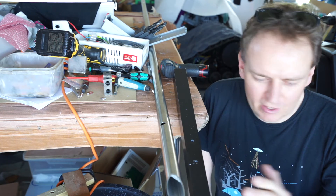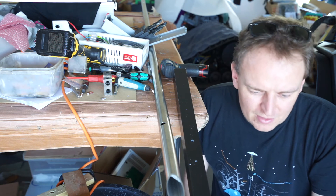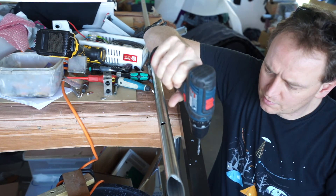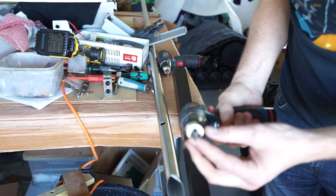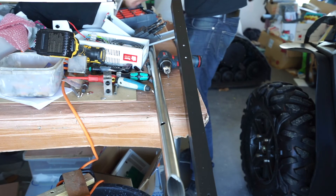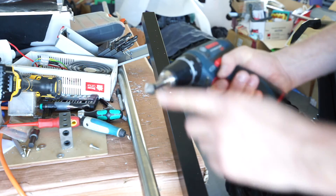I'm here at Jason's house. We just realised we're going to put a thread in these holes so we can bolt the feet directly on without any nuts on the other side — we'll probably put a nut on the other side as well just to stop it coming loose, but it'll be super strong. We cleared all the holes with the drill to make sure they're clear of paint, and next we're putting the threads in using a threading bit. Just like that — beautiful. Final step: add a very light countersink to the holes.